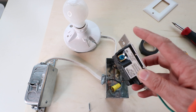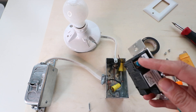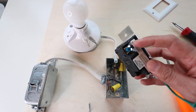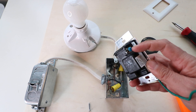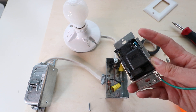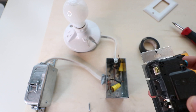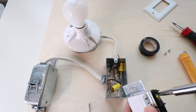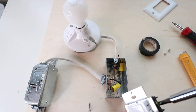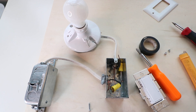There's an extra blue screw on this switch — that is for three-way switching applications. We're not going to cover that in this video, but we have other three-way switching videos, so check those out. We will not need that blue screw here. Now we're going to loosen up the terminals so we can wrap the wires around the screws.